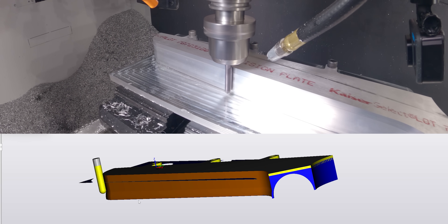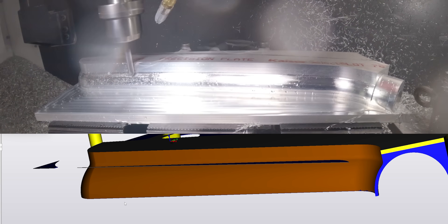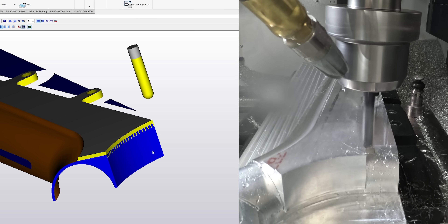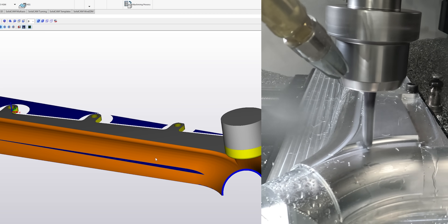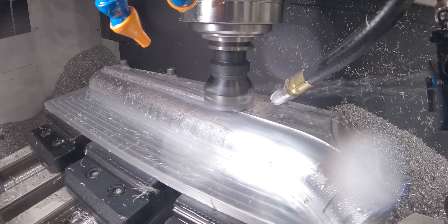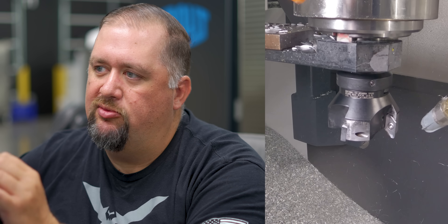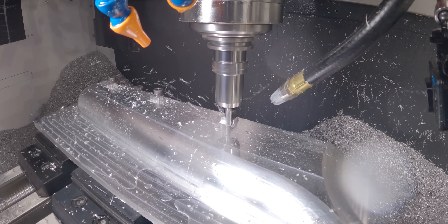You can see here we're working our way from the bottom up. If this started to relieve, it's already been machined straight to finish size, so I don't have to worry about coming back when my part is now weak and floppy. Now we're going to do the same thing with the external fillet on the backside. Now that both fillets are done, I can come and face this material off the top to get to our eighth-inch thickness, working from the outside towards our tabs. After we have the top of our part faced to thickness, the very last thing we're going to do is cut our tabs to about 20 thousandths thickness. The order of operations on a part like this is critical to achieving a good finished part.